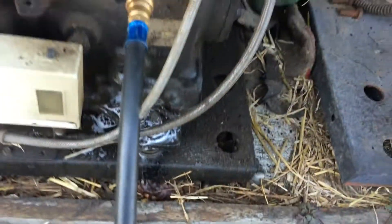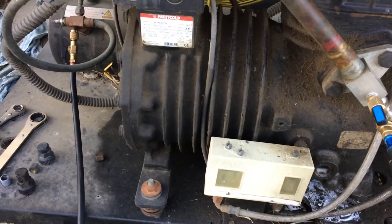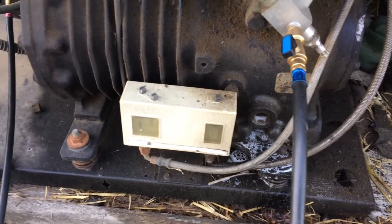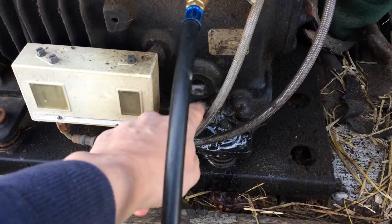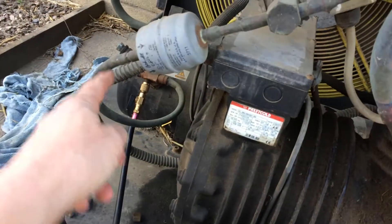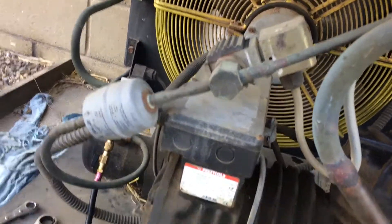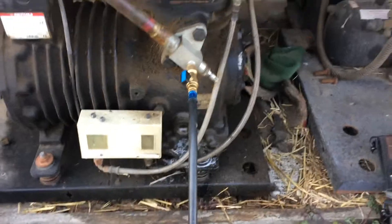So we're on a new hose. This is on R22 which we can't work with any more, so we're going to need to put a new hose on there. We'll change the sight glass because it's got rubber O-ring opening. We'll change the solenoid valve and put a new dryer in there as well. And change the gas — at least we haven't got to take the old gas out because it's all leaked out already.